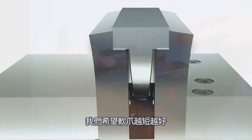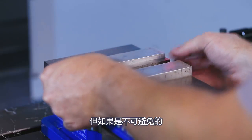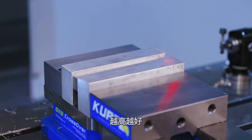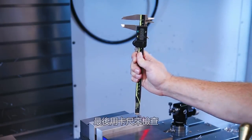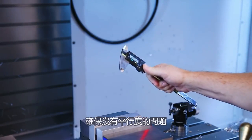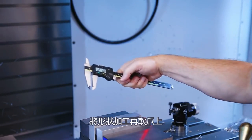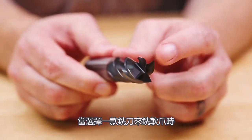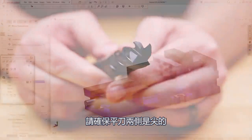In real life, we'll want to keep our jaws as short as possible to avoid deflection. But if it can't be avoided, keeping your spacers as high as possible in the jaws will give us a firm, constant part hold. One last check with calipers to make sure our parallels are out of the way of our cut. We'll take the profile of our part and cut that shape right into the jaw — it's a simple process, but there are some pitfalls that we need to avoid. When choosing an end mill to cut your jaws, make sure that it has sharp corners.